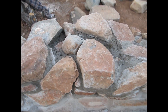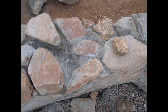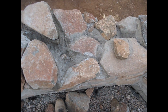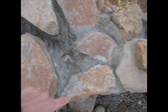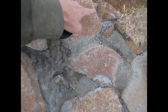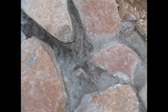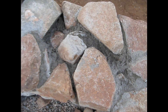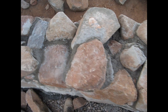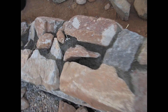It's looking good. We have the vertical seams as well as the horizontal seams, which you can't see now because they get covered up. Basically, as you have a seam running across this way, you want to take a rock and cover up those two sides. We're just mixing our own mortar with Portland.